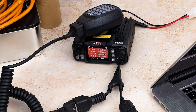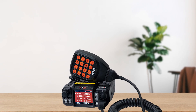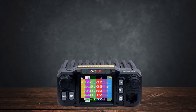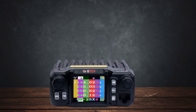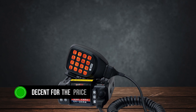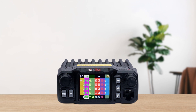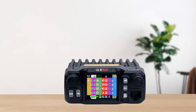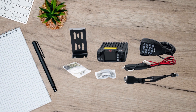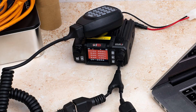Programming the radio can be done using CHIRP software, which is free and quite user-friendly. However, if you prefer a more straightforward approach and don't mind spending extra, the RT Systems software is an option, though it might feel overpriced for a budget radio. In terms of build quality, the BTEC UV25X4 is decent for the price but has some quirks — for example, the speaker jack requires a special 4-conductor plug instead of a standard 2-conductor one. Also, the radio can be susceptible to interference if placed near HF, CB, or 6-meter antennas, causing it to freak out with loud spurts and growls.